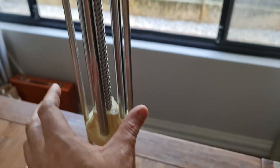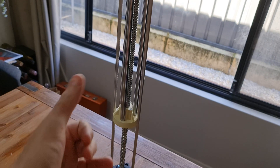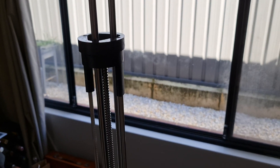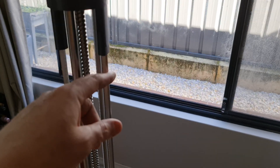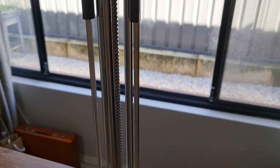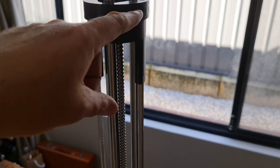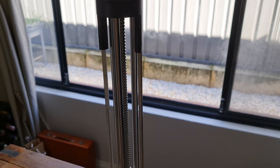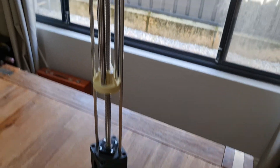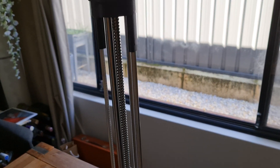With the last system I used these exact sliders and it actually acts as a clamping force — it clamps it to the tube — and that's worked well for over 12 months, so I'm going back to that system. These are my old rods so they don't actually incorporate the new length of the ball screw, so they're a bit short. I'm losing probably 50mm of travel because of these, but if this works out I'll get new ones ordered the right size and get an extra 50mm travel.